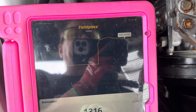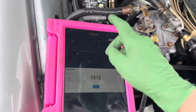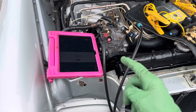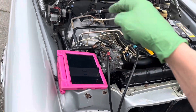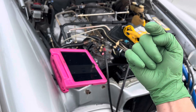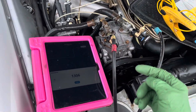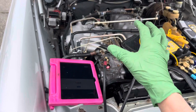The system is stabilizing — it's no longer leaking. But we know every one of these hoses has a massive leak on them. Analog gauges can't find this. And if you have a teacher teaching you using analog gauges in school, either tell them to shape up or ship out — because we don't need instructors in our schools teaching students to use vacuum to look for leaks.